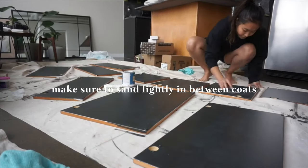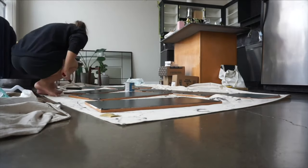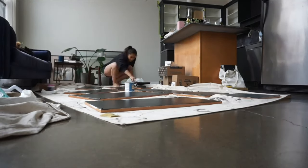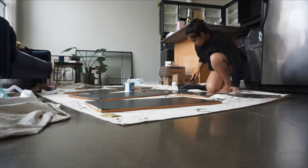With the paint, I did three layers of a pretty light coat to get the smoothest finish possible and an opaque black. With a high-quality paint you can get away with two layers, but I'm very type A, so I did three. Once that was done, I left about one to two days before flipping the doors over to do the front side, then repeated the same process. I honestly think it would be better to wait three to four days, because even with two days I ended up with a few dents from the doors resting on boxes or solo cups. If you're filling the holes, do that after the cleaning stage, then sand that down to get the flattest surface possible — two coats of primer, three coats of paint.